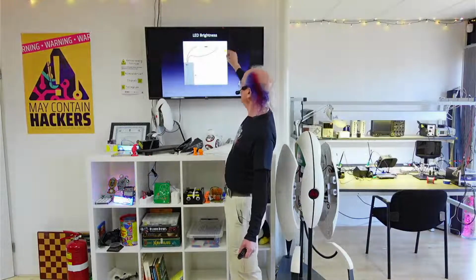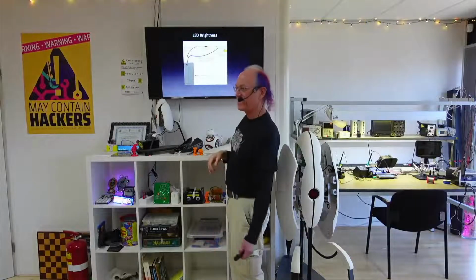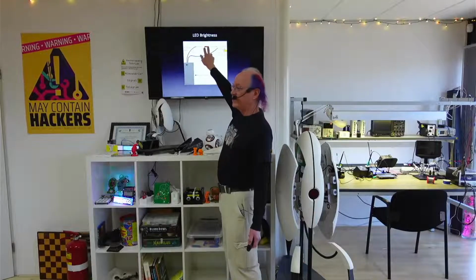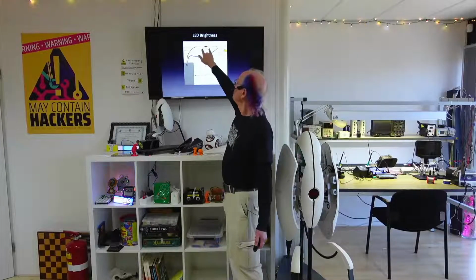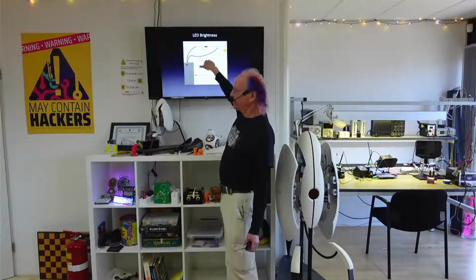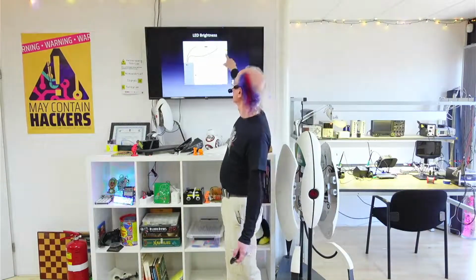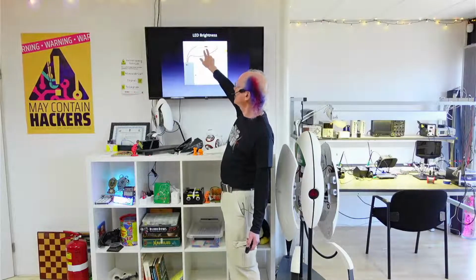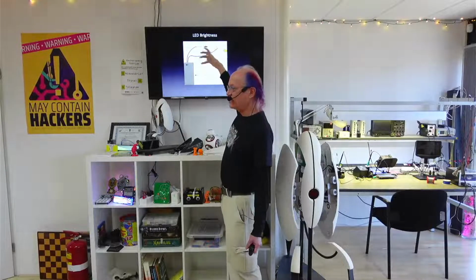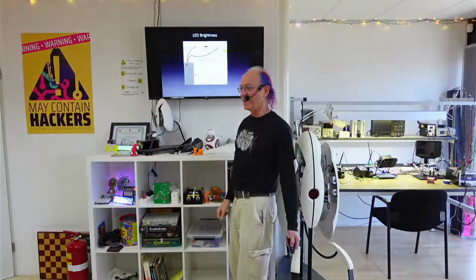This looks like a yellow LED, so it'll put out yellow light. And you turn the switch off, and of course, the electrons aren't flowing anymore, so it turns off. Depending on the resistor here, if we have a bigger value of resistor, that will put more resistance to the flow, so the current will be less, the electrons are flowing slower, so this will be dimmer. If we have a lower value resistor, there's less resistance, so the electrons will go faster, more current, more amps, and this gets more excited, more light, more yellow in our lives.